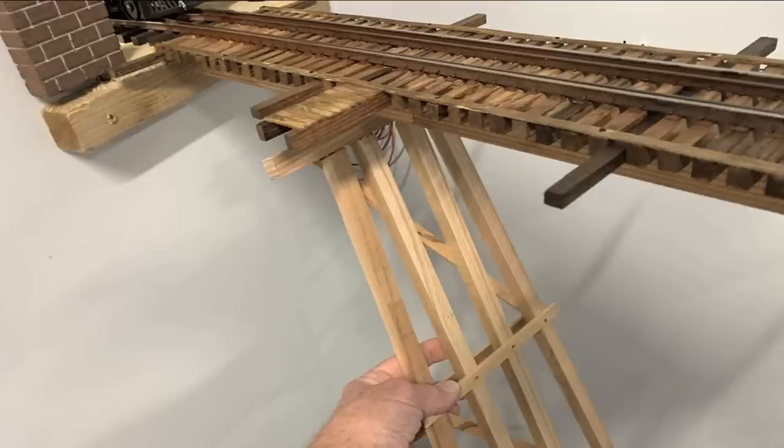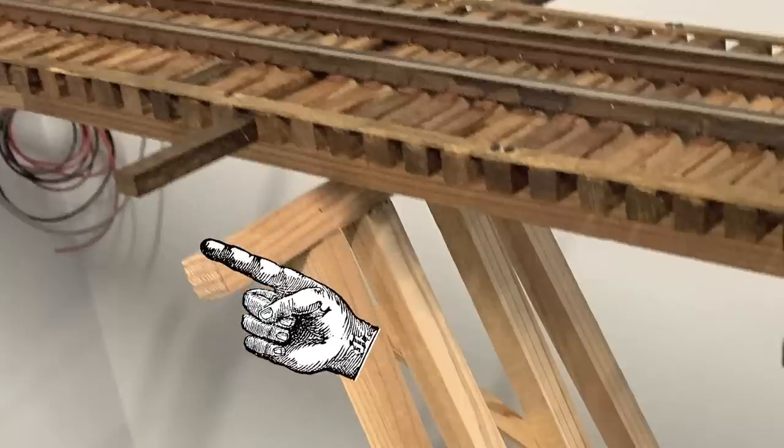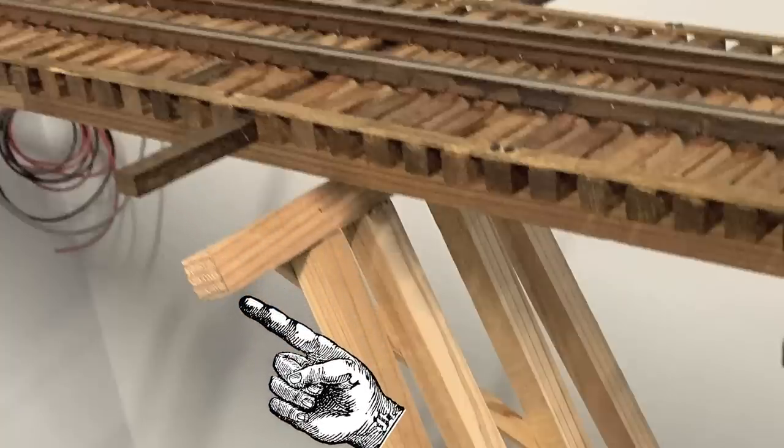Right. Now, it's easy to find on the deck where the bents are going to go, because at each of those locations is one of these extensions for the railings that you suggested. Right, I still am afraid of a train falling off. Right, me too. So that was a good idea you came up with, to have that little brace there. So there's going to be a railing attached there, but because that's directly on top of each bent, then that makes it very easy to see where the bents need to go as I'm setting these in here to measure them and cut them off to the correct height.